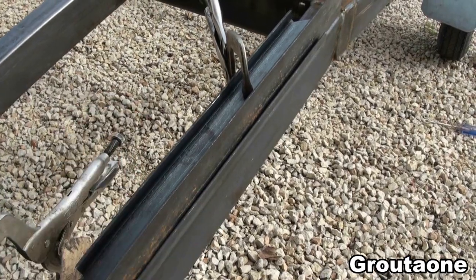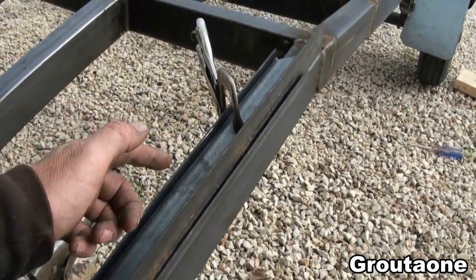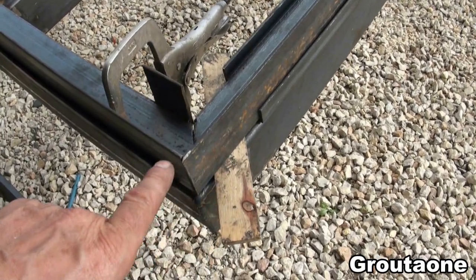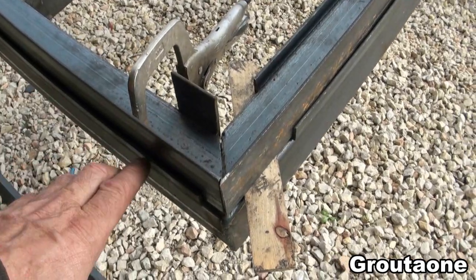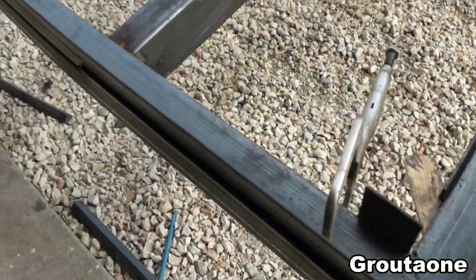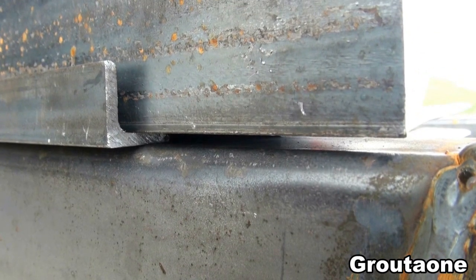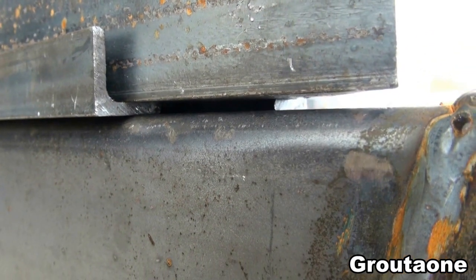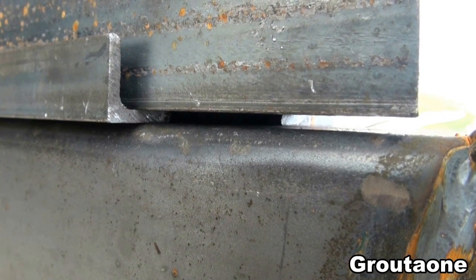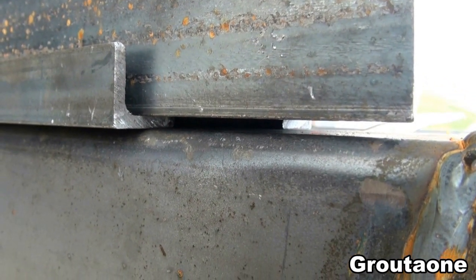The spacers are underneath the angle that I want to use, then clamped down. This end was a little low, so I'm using a wood shim to raise it up a bit. I'm also using spacers here and under here, then clamped down — same idea on this side too. So the spacers underneath create a bit of a gap, and hopefully that gap is going to be enough to help prevent welding the swing-out part to the trailer itself.